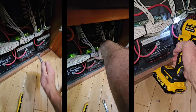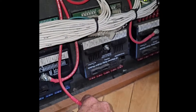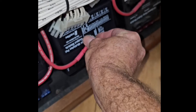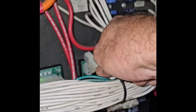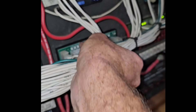Let's unplug the old one. Right there is the power supply that switches to the outputs — it runs power to this bus bar with overcurrent protection above. We'll remove the old one and install the new one that I've programmed for the right address, then connect the 12-volt power back up. Now this two-pin plug is the network connection — it doesn't look like a SCSI cable, but that's the computer cable. The other two connectors are just the outputs that go out to the lights and other functions.